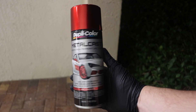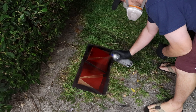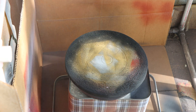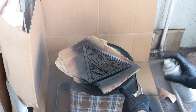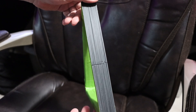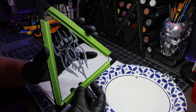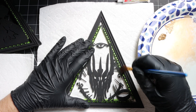I followed up with a coat of Duplicolor Red Metal Cast, a transparent spray paint to bring out an even more red look, as the resin alone was a bit too see-through. After 24 hours, another layer of matte clear coat to add even more diffusion. For the outer panels, I applied two coats of Krylon Flat Black, and also applied the same flat black to the edges of the offset panels so they matched. Once dried, I began thinking about the final look — wanting the holocron to look ancient and used — and using some rub and buff antique gold, began doing some sporadic dry brushing.